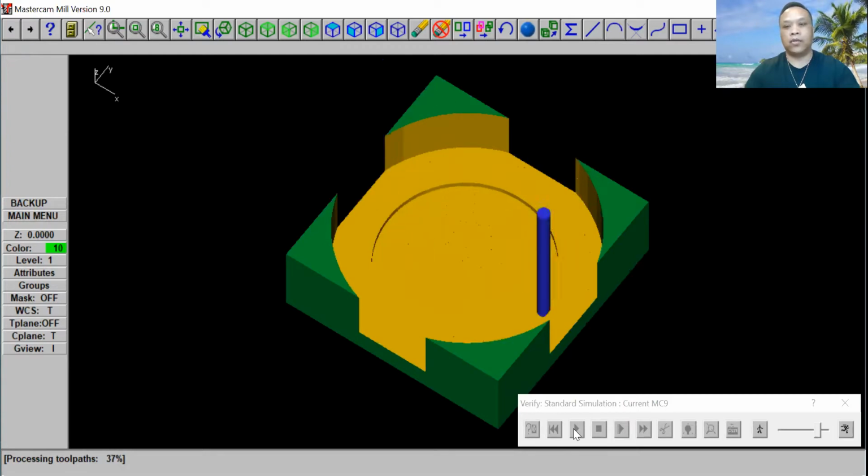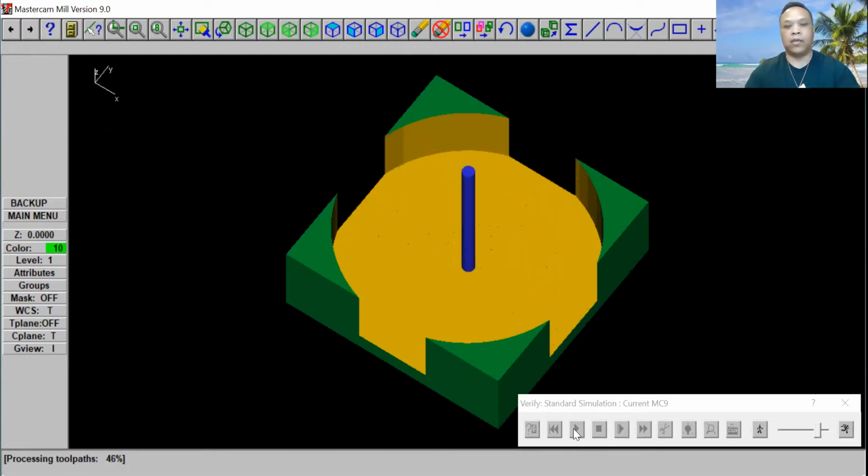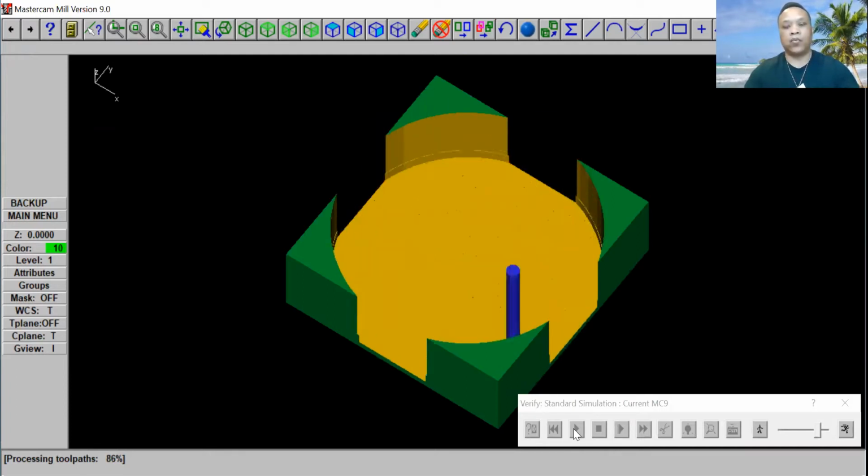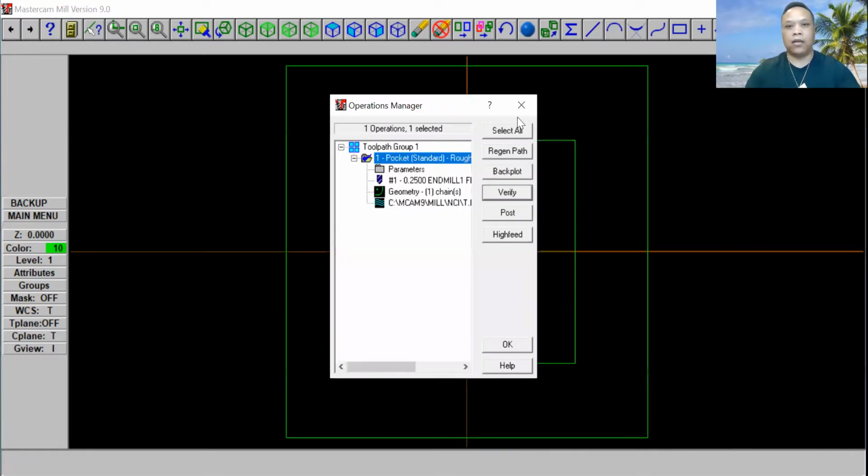You can set up on the Z and you go step by step. Now, if you have a monitor at your machine, you're going to adjust the Z one at a time. Let's just say you go half inch, then a quarter inch, and then half inch, and so on. Now, if you want to run 1 inch deep, you can go a quarter and then a half and then a 1 inch, okay? So that's what it looks like. That's what we were talking about today, okay?